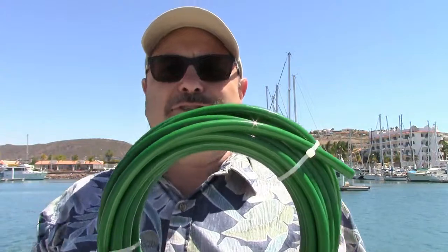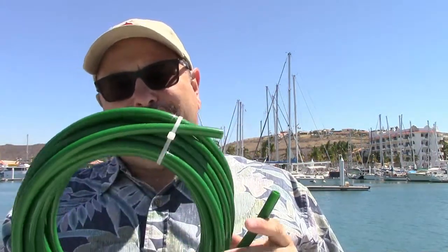There's a reason we provide 30 feet of the green line and not 90 feet. If you need more of this half-inch line, you need to talk to us, because that means you could have more suction on the inlet side of the system than what we designed the boost pump and basic plumbing for. Typically we don't like to see more than 10 feet of inlet suction side — from the through-hull, through the gray valves on the valving and cleaning assembly, into the inlet of the boost pump — 10 to 15 feet max. If you need to go over that, we need to talk about your layout and possibly upsizing your half-inch green line to three-quarter.